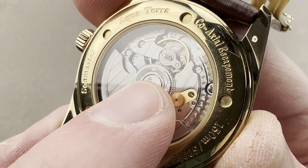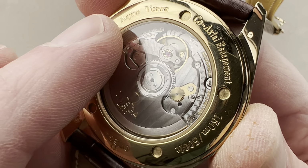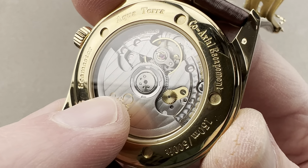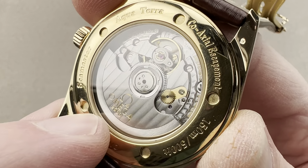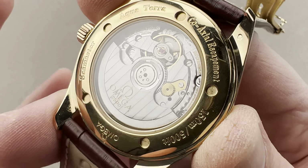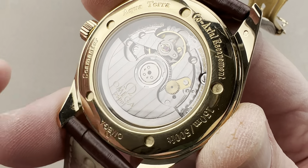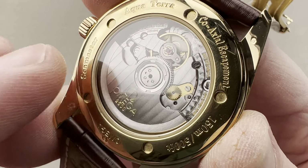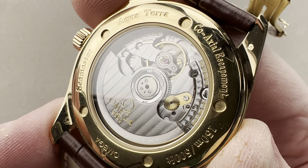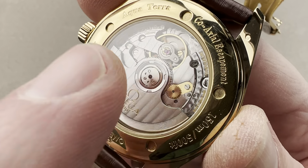And so the Charlie was introduced, and the big change is that the rate goes from 4 Hertz to 3.5 Hertz, which is more native to the mechanism, as it features the coaxial built into what was formerly an ETA 2892A2 architecture. So it is a 2892A2, albeit highly modified, and in this, the Charlie, or third revision, Omega finally found respectable reliability and durability. So you want a Charlie or later if you're doing one of these. And if you do find an Alpha, keep it. Even if it doesn't run, they're so rare that in non-functional form, they're worth a lot of money. But for everyday use, you want a Charlie or later.